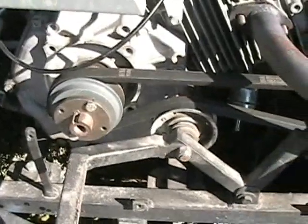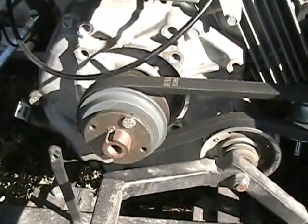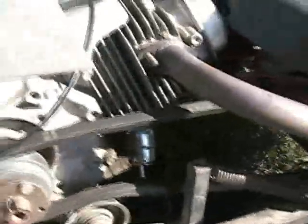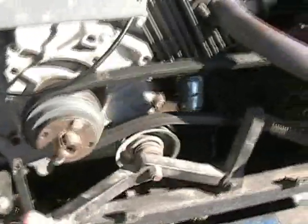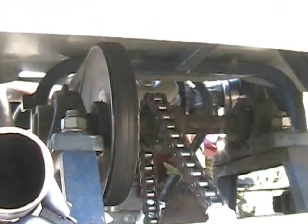Maybe I'll take this cover off and show you how the drive works. Here's under that cover — the drive system. It's just a single B belt with an idler mounted on this pedal here. You push it, it just releases tension on the belt, so it's just one gear. It works very good — back to a jackshaft here, pulley there, sprocket. Very simple.